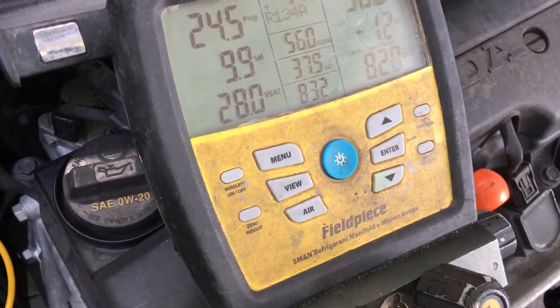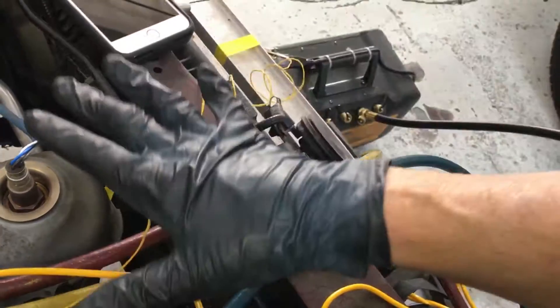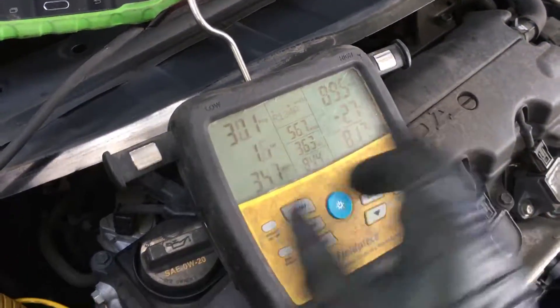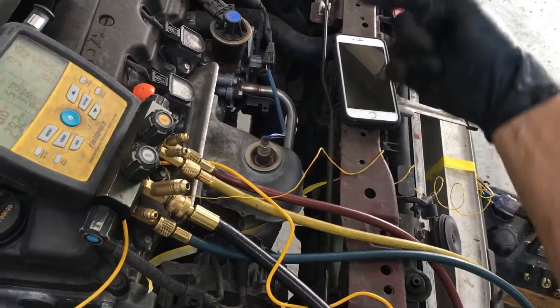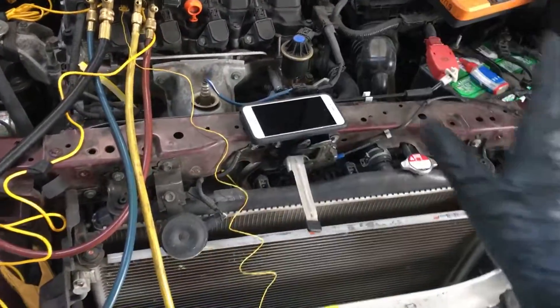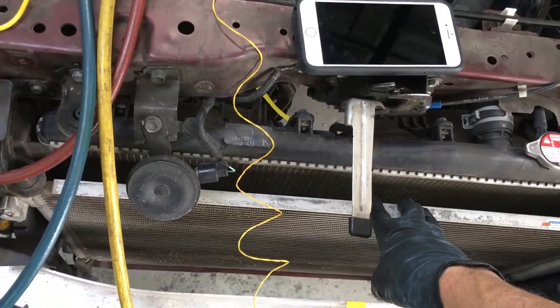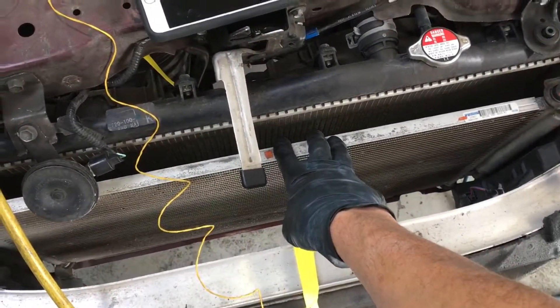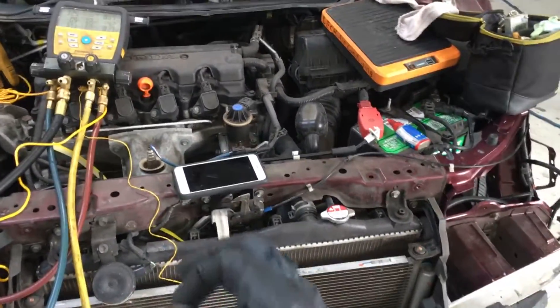In this situation we have pulsating fans — fans that are not steady — and this is one of the problems when you're trying to read superheat and subcooling on a system that has pulsating fans, varying fans, or ones that kick one fan on and then another. Some aftermarket condenser manufacturers actually say that if you get one of their condensers you just have to reduce the charge and watch your superheat or subcooling — unless you only do one make and model vehicle and know it really well.